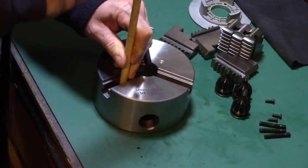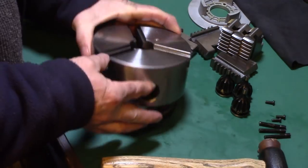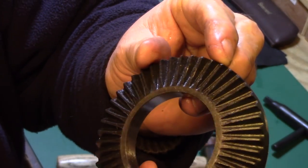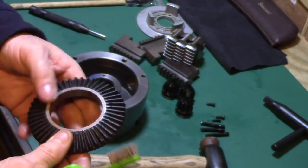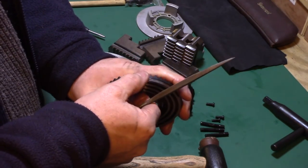The scroll plate was gently tapped out from the chuck using a wooden dowel and a mallet and inspected for any defects. Both the main scroll bevel gear and the pinion gears looked to be cast components with a mill finish to the gears — acceptable but by no means precision manufactured, as there were a few minor rough edges and burrs, but these were easily taken care of with a file.